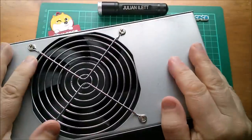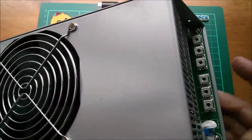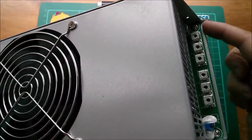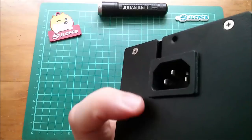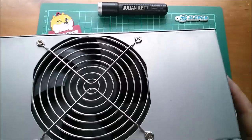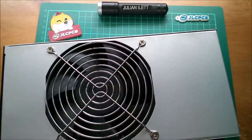Good morning. This is a power supply, and it's a single output power supply despite these multiple screw terminals — it's just 12 volts. These are just paralleled up: 12 volts paralleled up, ground at the other end, IEC mains in, and that's really all there is to this thing. It's pretty straightforward, but this is a very high current power supply.